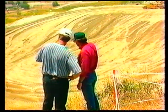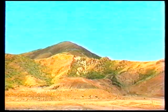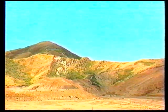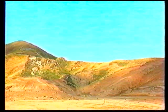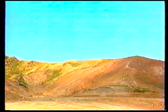Look over the terrain. This will allow you to get an overview of the best way to approach the job. Notice uneven areas or low-lying areas. These are potential areas that collect leaves, branches, trash, and so forth, which can pack up tracks and reduce traction. Large rocks can also reduce traction and contribute to an operator losing control of the machine. Also, be alert for wet areas that could contain underground springs.